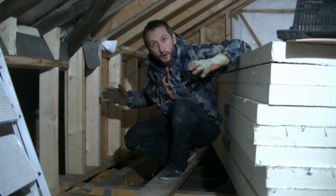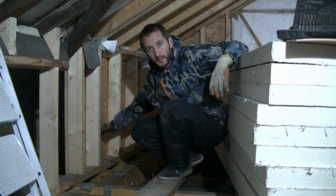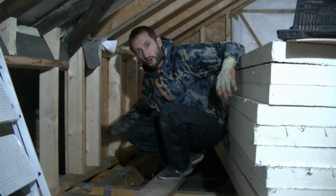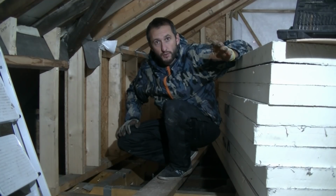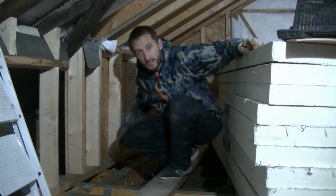And what I'm going to do is just run the wire then straight to the lights and straight to the switch. That way I can put like a little accessible unit down here in the wall, so if there's any other problems with the connections, I can whip the front off that and you've got good access there. You shouldn't have any joins then in the ceilings at all, and the only place that you'll have any splits or breaks in the cable will be at the light, down here at the junction boxes, or at the light switch.